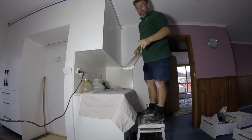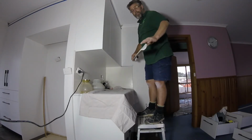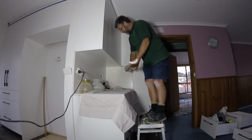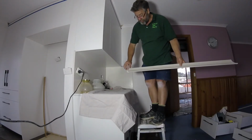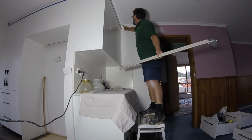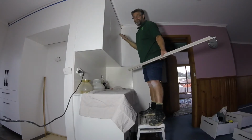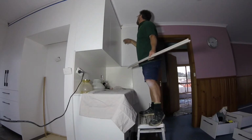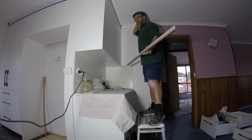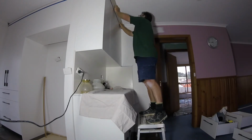Always remember, ceiling angle goes in the box. You're sort of cutting it backwards and upside down sort of thing. So you just got to visualise. When you're doing internals, your ceiling angle's always shorter. So there's your ceiling angle. It's shorter than your... If you're doing a room, basically you've got 4 internals. So it's pretty easy. You've got a left hand internal and a right hand internal. And that's how we do it.